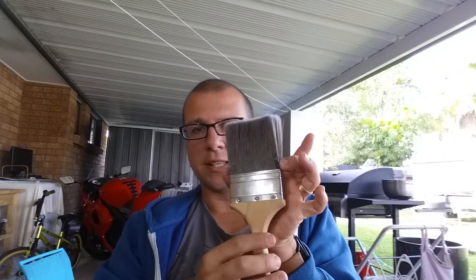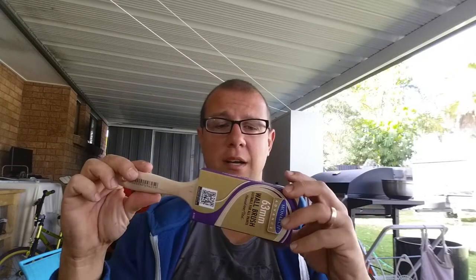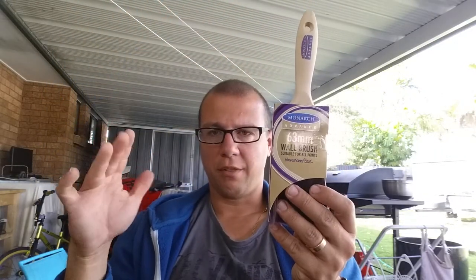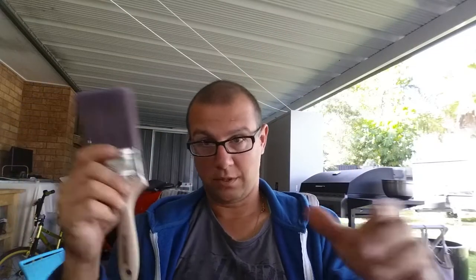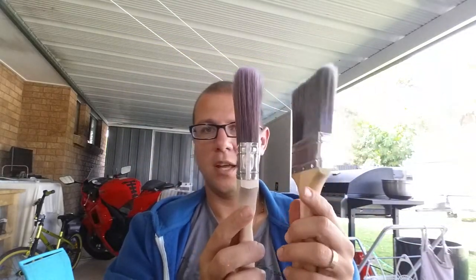The width is the other thing people get scared off by. A lot of painters paint with a 75 mil, or sometimes with a 100 mil. For wall painting brushes I would definitely try to stick with one of these. For those of you new to painting, I would go with a 63 mil - this is a brand new 63 mil Monarch Advance. It's a better $30 brush and it's a good compromise: it's not too scary, but it's also wide enough.